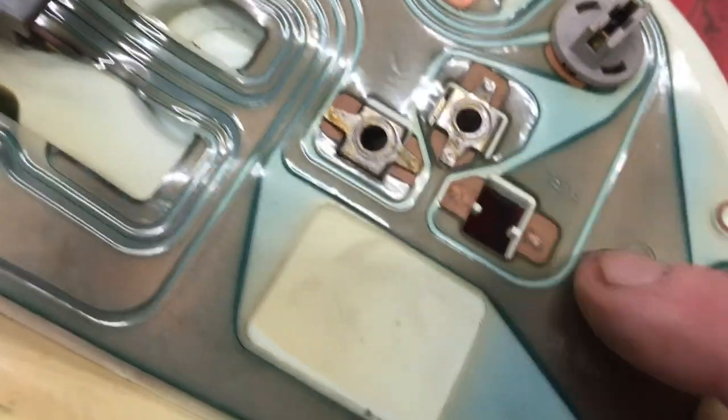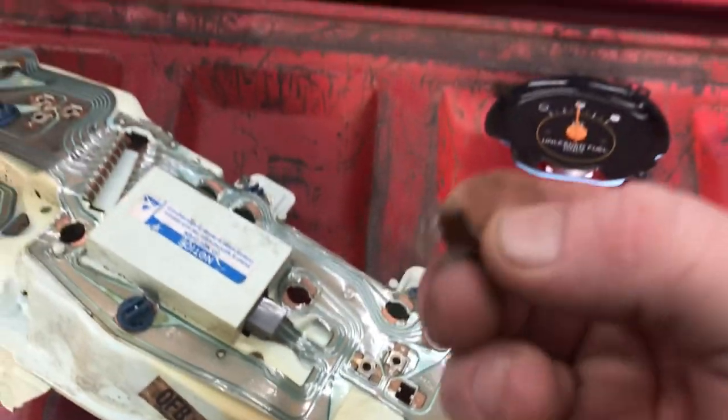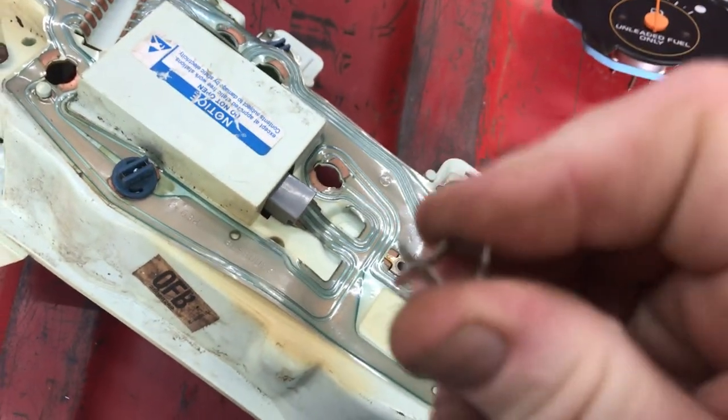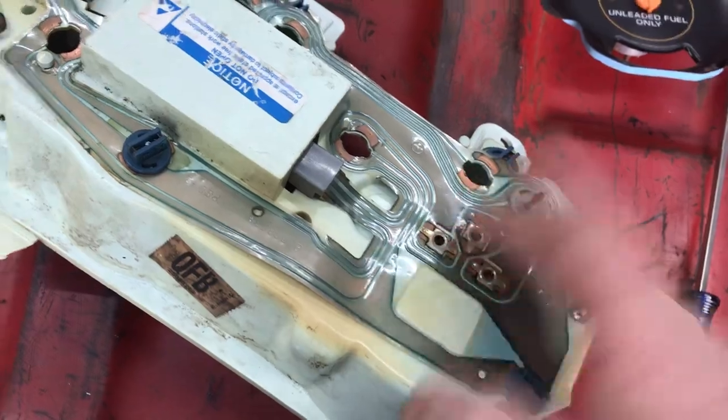The biggest issues with these again come from these little clips. Let me pop one out and show you what I'm talking about. They just mash out — just pop it out just like that. You can see here where this makes a connection. Take a little razor blade or screwdriver and just clean that trace up if it's got any corrosion. This one actually doesn't look bad. Take this piece — see those little ears? That's what grabs the board. Bend those down, make sure they're good and clean, and mash it back together so it grabs the back of this a little bit better. Then just pop it back down — just like that. Real simple.